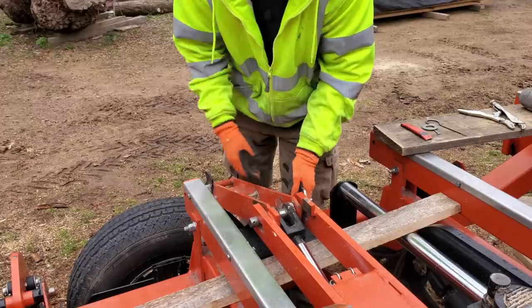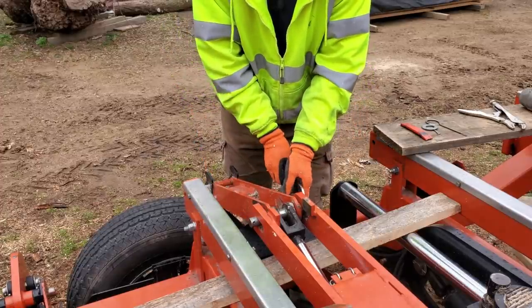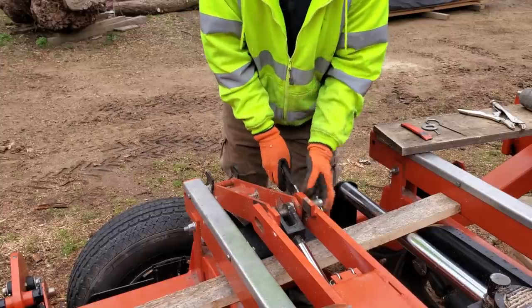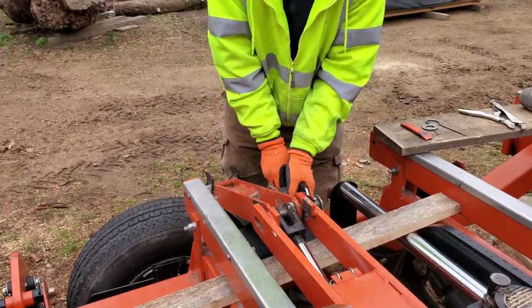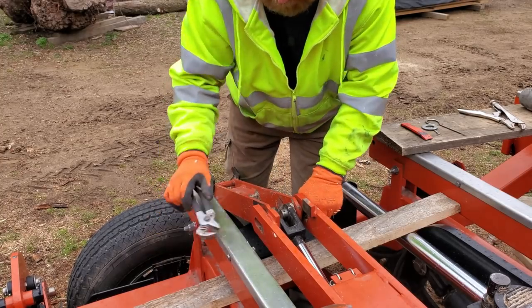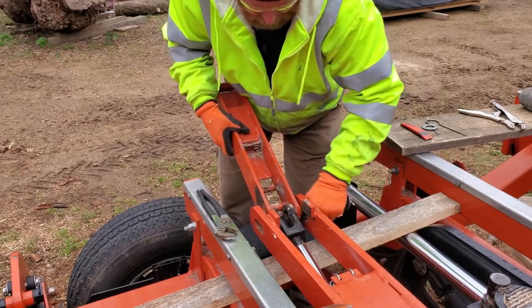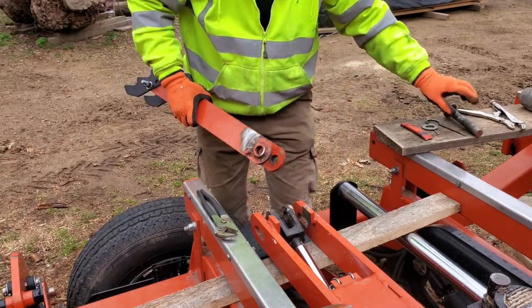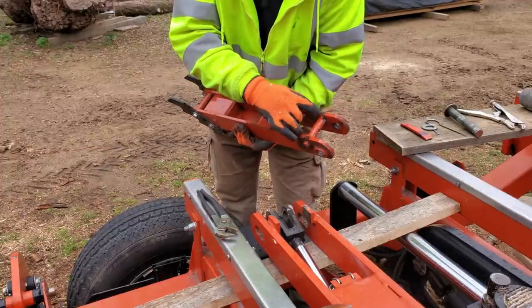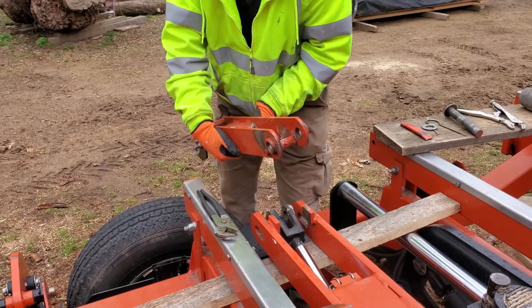See? There we go. Normally, this arm should not go back this far. That's what happens when it rolls over the back of this and breaks that stop off. So there we go. Now we're moving. One of the reasons to keep your mill regularly lubed. If not, this pin will corrode itself in there. You have a heck of a time getting it out. There we go. All right. And you can see the markings on the back of here where it's hit the stop pretty hard too. It's dented pretty well, but that's it. Let's set this aside.